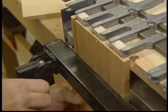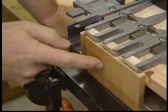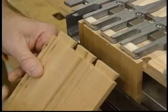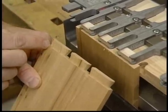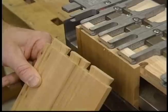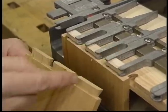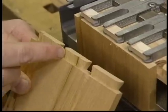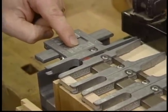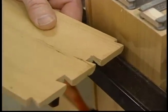First, I mount one of the side pieces in the jig. The reason I like to mill the grooves first is so I get the pieces in the right orientation — the inside of the drawer always has to face out; if I see the groove, I know I've done the right thing. Here's a piece I've already milled as the final product. I want a half pin on each end and I'm going to use three tails — you can adjust the fingers for any number. I also have to put in little blocks so the router doesn't slip between the fingers; I want to remove just a little bit of material. I also have to keep in mind the adjustment in and out of the jig, set on the dial to the thickness of the stock — three-eighths of an inch. I also install a backer board to minimize any tear-out on the side that's going to show as the bit goes through.